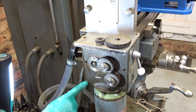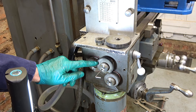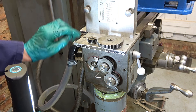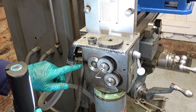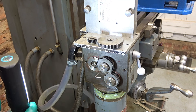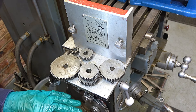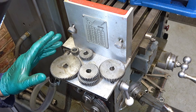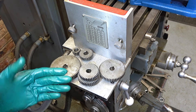Next I need to set up the traverse speed. The gears I want are a 22 and a 59, as shown on the table on screen. That will give me 31 millimeters per minute of feed — about an inch and a quarter per minute — which I'm hoping is about right for horizontal milling with five inch cutters. The gears that came out don't have numbers on them; by deduction I know they're a 43 and a 38. All the others have numbers except the 17, so it's a mystery why those two weren't marked.